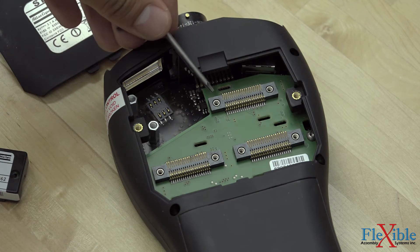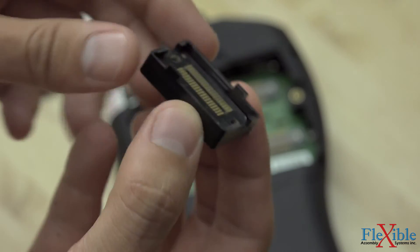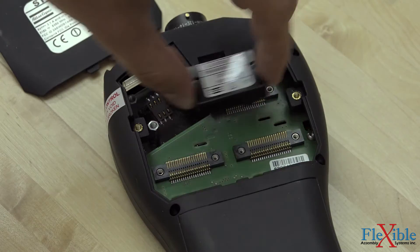For the STA-6000, it is the opposite — we will have to use the screws instead, since the nuts are embedded into the unit. When you examine your RBU, you will notice that it has two plastic tabs extruding from its base. These tabs must line up with the slots on the PCB in order for the RBU to sit flush.